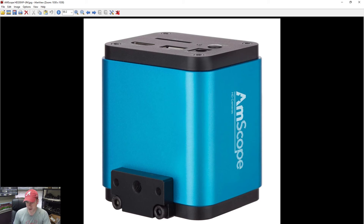I should also mention the alcohol pump — it's like a nail polish remover pump. When you're working on a board and need a little isopropyl alcohol to clean an area without putting it in the ultrasonic cleaner, you pump a little onto a cotton swab or paper towel and clean as you work. Really handy to have on your bench.